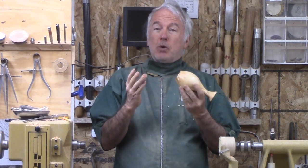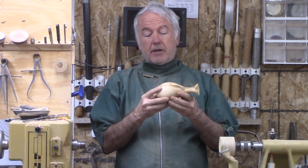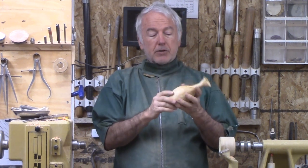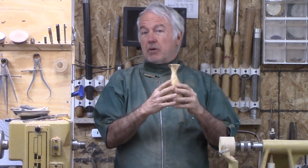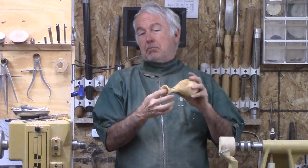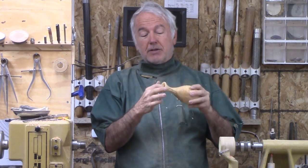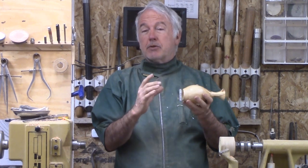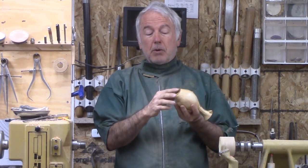I picked up this wood in Arizona. This was just an olive log — one of the smaller logs — so this is the entire center of the log. I had to remove the pith, which lends itself to being a vase. I drilled out the center and also drilled out the base so that there's no pith in the whole thing. Then I plugged the base.